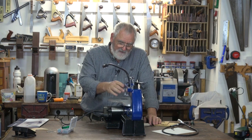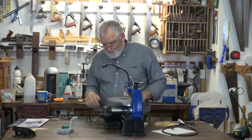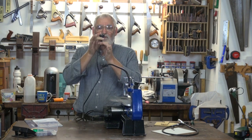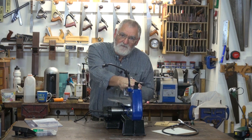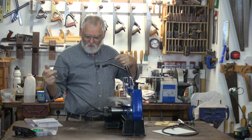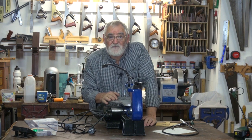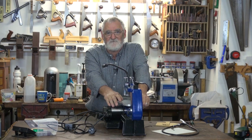For general safety and operation, obviously keep the guard in place and keep your fingers away from the blade. Keep the cables nice and tidy so you don't trip over them. When doing a visual inspection on the machine, the first thing I always do is remove the plug — once I've removed it, I've taken the machine from the power source and it's now safe to work around. Check to make sure all the tangs of the plug are straight, the cord isn't frayed, chipped, or exposed in any way. Do the same with the foot pedal — make sure it's totally covered with insulation and everything is working and not gummed up with timber. That wraps up the tutorial of the SS400H scroll saw from Carbatech — may you enjoy many years of good, creative, and fun woodworking. Thank you.